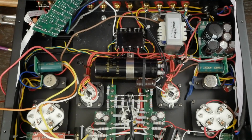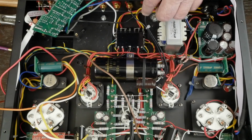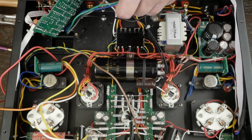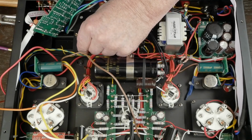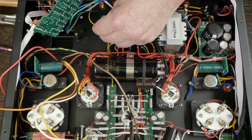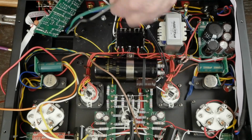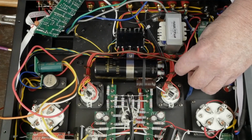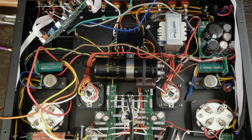On the speaker wires, the black is the ground, and it's going to go to this ground lead. Then we have a ground that goes from the speaker jack up to the negative of this cap. The green wire is the 16 ohm. It goes to this outboard terminal, and then we bring this yellow wire here that goes over to the global feedback loop. It connects also to the 16 ohm speaker terminal. Blue is the 8 ohm, gray is the 4 ohm. So let me get all these wires connected up, get this connected over here to the tube, and this run over here to our high voltage DC. Screw down this little circuit board to these two standoffs, and we'll be done installing the transformers.